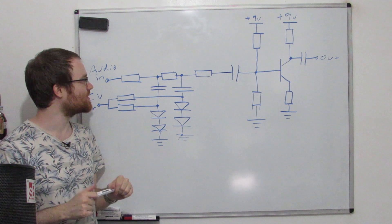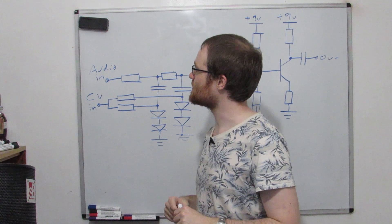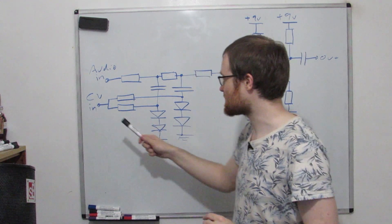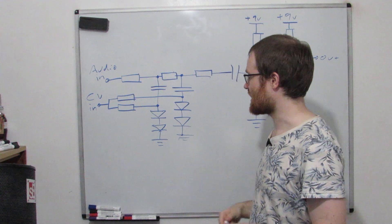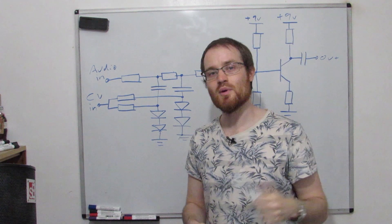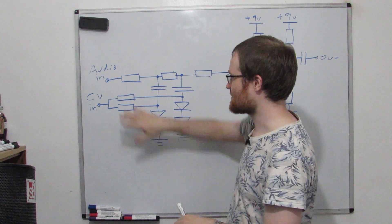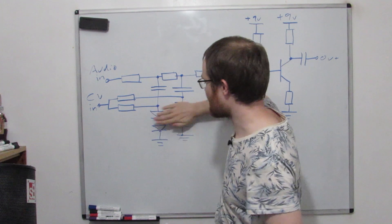This is a schematic for that circuit I just built up on the breadboard. There's one caveat that makes this circuit a little bit strange, which is that the audio input can't be higher than about a volt — that's because of this filtering stage. The control voltage, that's what CV means for the filter, is applied to the anodes of these two diodes, with the other leg of each diode essentially connected to ground. A diode is switched off when the anode is less than 0.6 volts more positive than the cathode. So with no audio input, everything is zero volts, so these diodes are switched off and look like an open circuit.